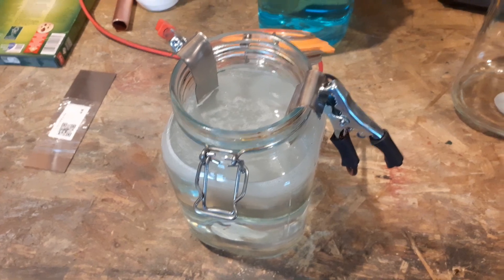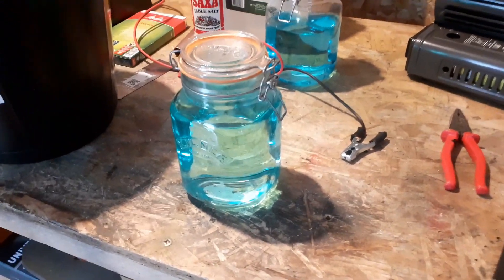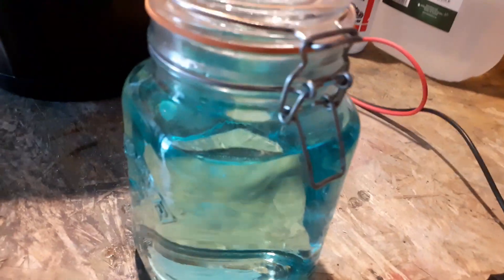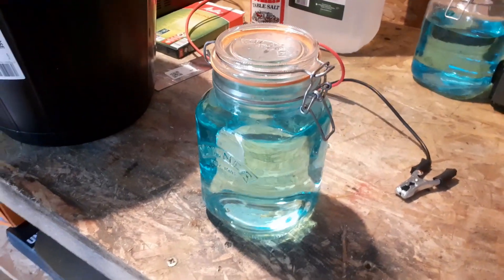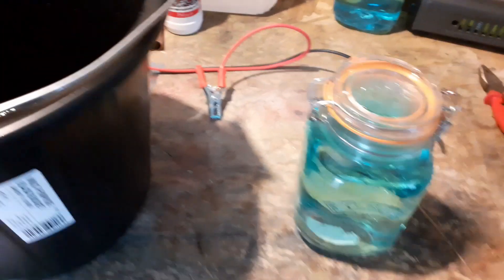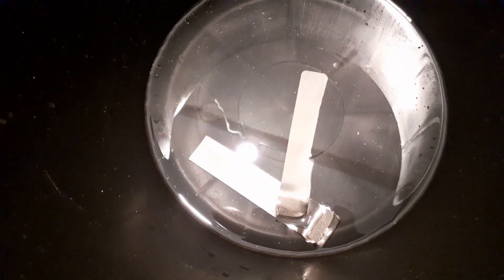Hi folks, we're back after one hour of doing the electrolysis on the nickel. I don't know whether you can see that there — it looks blue but it's actually green. It looks kind of blue on camera but it's green. That was run at 13.8 volts for one hour. I just took out the two pieces and they're in purified water — they actually look okay, not too bad.